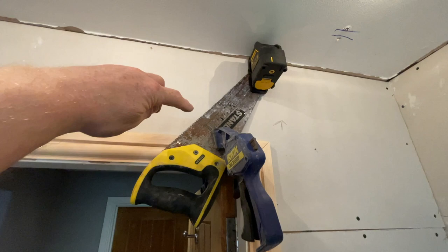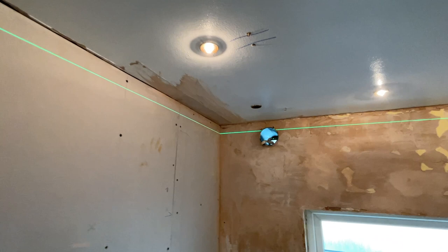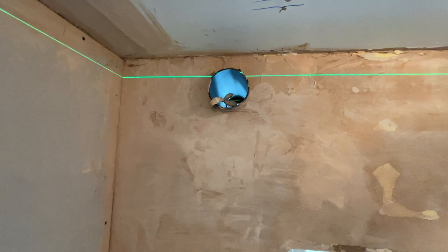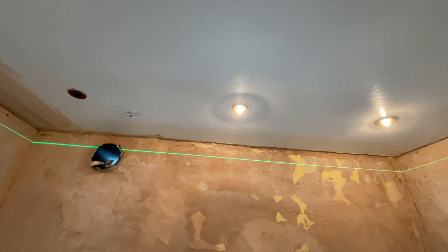I've done a little trick here — I just put my saw, clamp it to the door or wall, and then get the laser level up because it's magnetic on the back. One thing I've noticed is that I spent all that time for the vent and it's not going to go in, so I'm going to have to fill that hole and put the vent in the center of the bath and go out through the gable end.